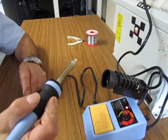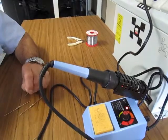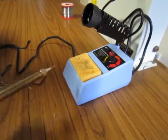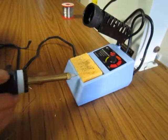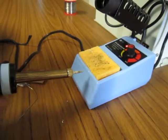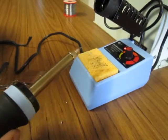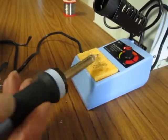Always be careful, and whenever you're not using it, put it back in its holder. You'll need to clean the tip of the soldering iron. Be careful that you do not touch the plastic holding the sponge, as the plastic will get deposited onto the tip and this makes it even harder to clean the tip.